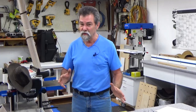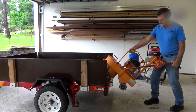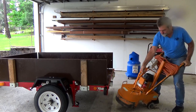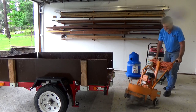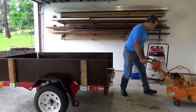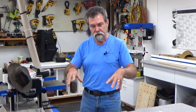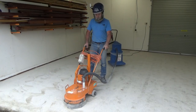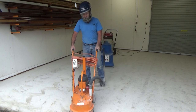The trick is getting the machines out on your own at the other end — this grinder is a fair weight, probably 80-plus kilos. The setup I hired was an industrial vac, a 300 millimetre diameter grinder, and a separator. They all work in conjunction: the dust from the grinder goes through the separator, which works like a cyclone and drops it into a plastic bag at the bottom of a bucket, and the remainder goes to the dust extractor. I wore my helmet because even with the vacuum running it's not picking everything up.